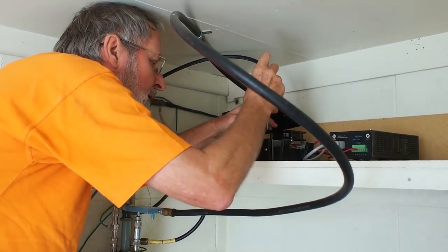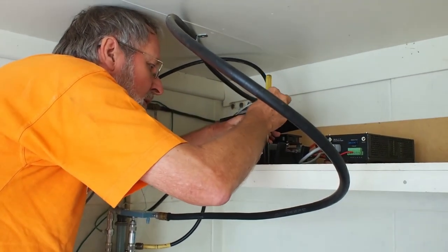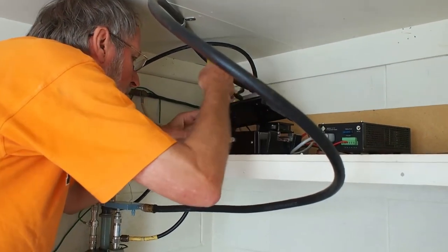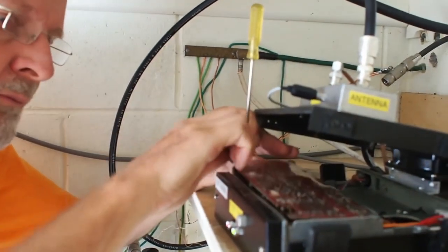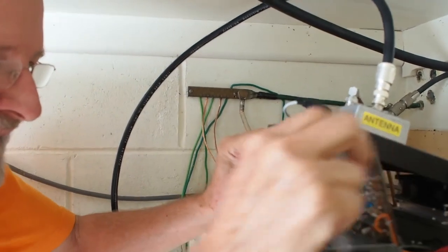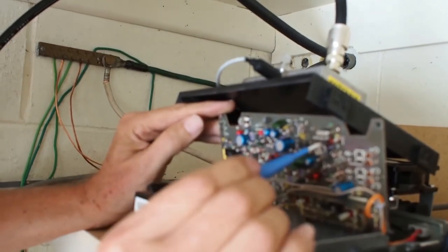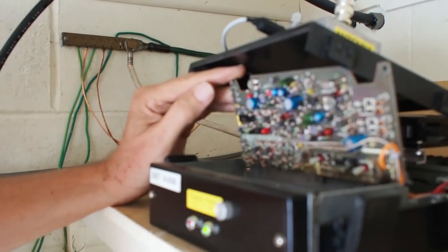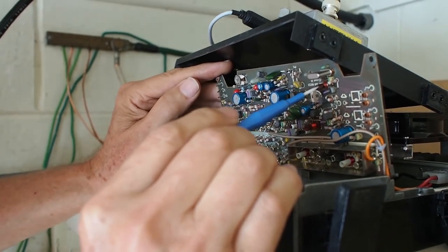If it's on the other side, how can touching it change the frequency? Because all the printed circuit board stuff is still on this side of the board. It's an FM828, heavily modified — there's not much of it left. Adam stripped quite a bit off; it's just the exciter board and the PA essentially. This is going to have to be a bit of a fudge-factor thing — I'll put the lid down. I've got some adjusting tools in here.